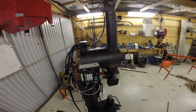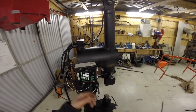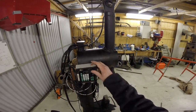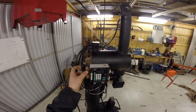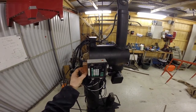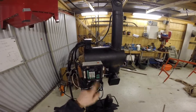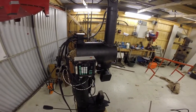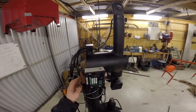The control board I use is an Arduino board. This might look advanced but it's not — it's just a casing I found, with an Arduino board inside and a connection shield which makes it easier to put the cables in. I have a small switch to change settings like stroke length. This is a 3D-printed box with copper tape around it, with the ground soldered to the outside, making it a shield box for the relay. The relay puts out a lot of interference which affects the processor, so you need to shield it. I also tried opto-couplers but that didn't help — the interference is actually moving through the air.